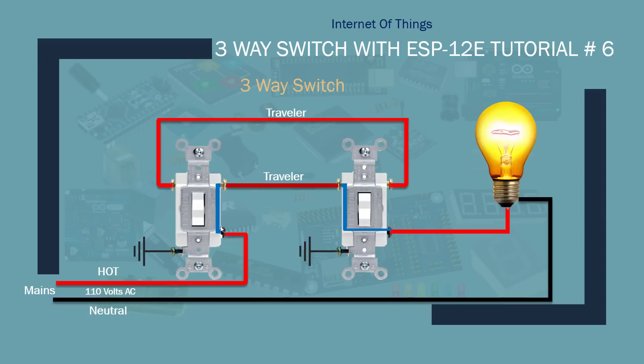When I flip one switch so the poles are connected, electricity has a full path to the bulb and it turns on. On three-way switches there is no fixed on or off position — it depends on what position the other switch is in. So flipping the second switch will turn the bulb off because it connects that pole differently and breaks the electricity path. That is the concept for three-way switching using two switches.